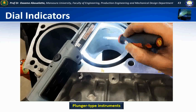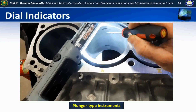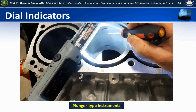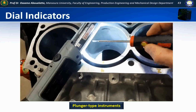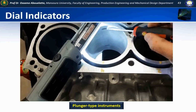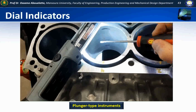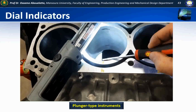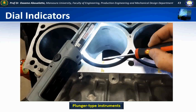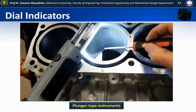As far as relation to the crankshaft, we should see our maximum wear 90 degrees to the center line of the crankshaft. Again, this is because of our major and minor thrust sides, and we know that the wrist pin is going to allow the piston to pivot in line with the crankshaft, which means that any tipping and transfer of force as the piston crosses over top dead center is going to happen at 90 degrees to the crankshaft. So when we're looking for cylinder wear, we're going to measure at 90 degrees to the crankshaft center line. Out of round, of course, we're going to have to check both. And for taper, we're going to look 90 degrees to the crankshaft center line again.